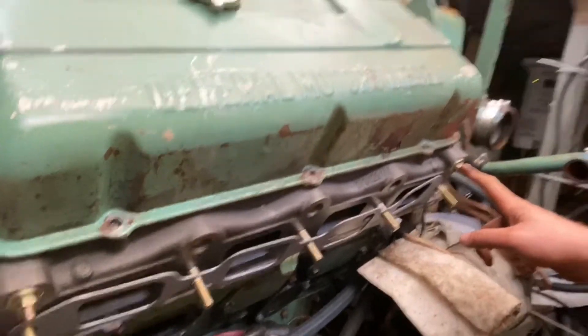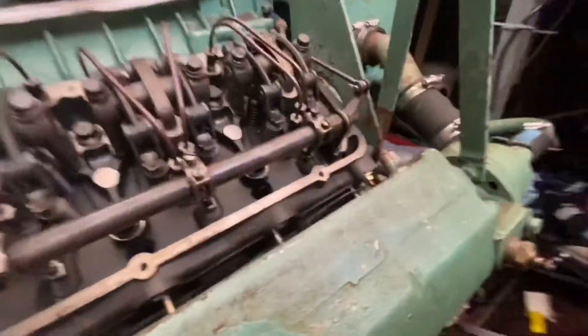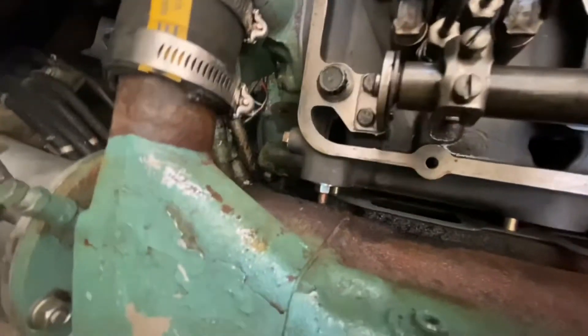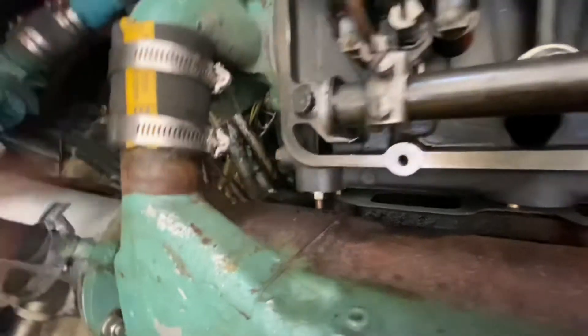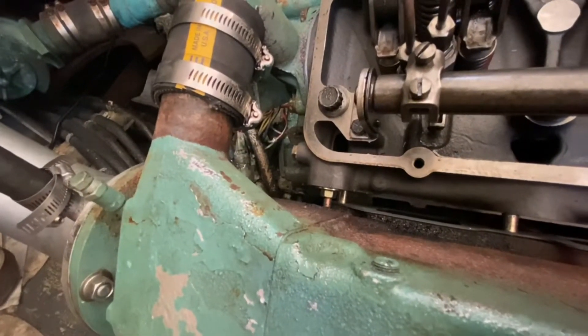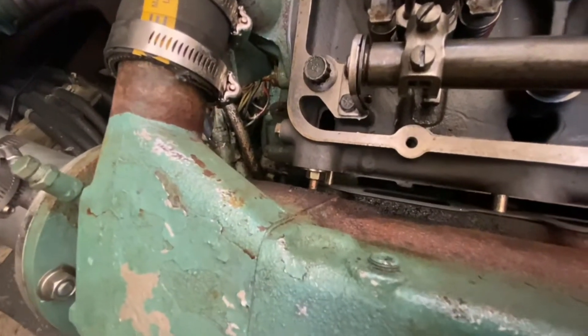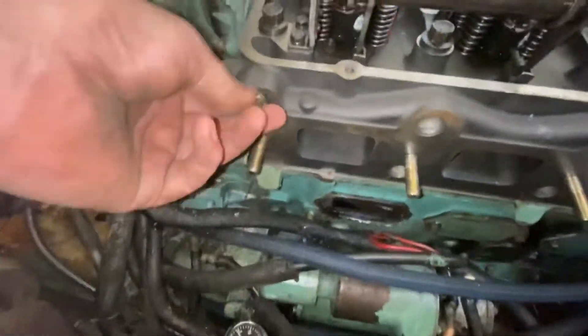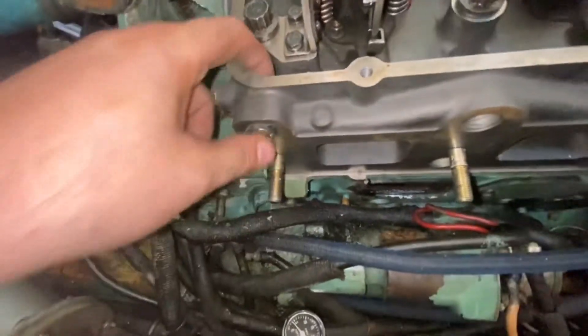That blows. I got it on sort of — one bolt is holding it in. You can see the gasket down there. This freeze plug is going to be my issue right here. I was worried it might be a problem since I didn't have the right freeze plug — it's an expansion plug and the exhaust manifold won't go on because it's pushing it back. So I reversed the plug so the thread faces inward, tapped it in really good, and I think that'll work fine even though the rubber bushing came off a little.